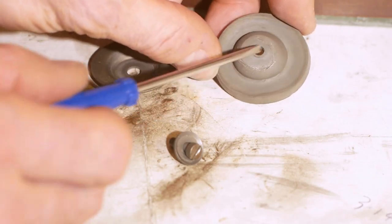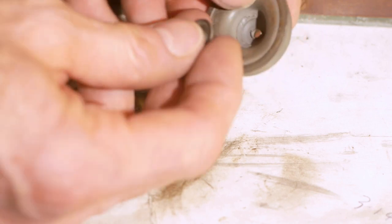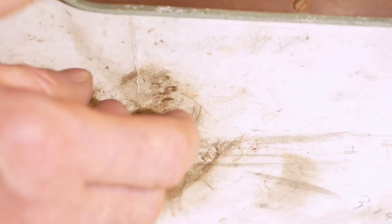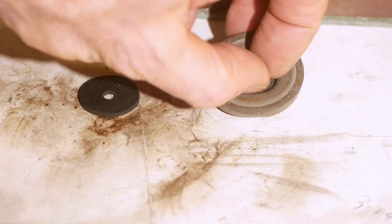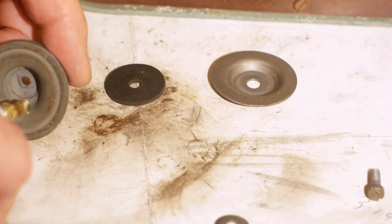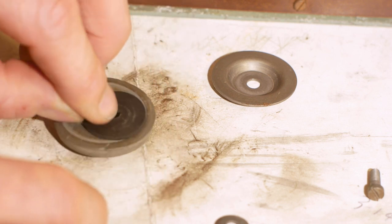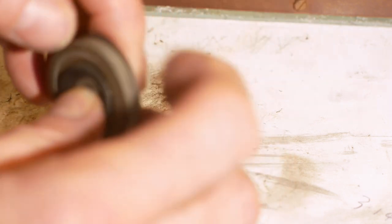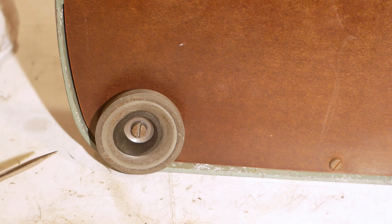For the torn foot, I've glued the tear together, but that won't be very strong. The normal method of assembly for these, there's a screw and a washer that passes through the rubber foot, and then it goes through another big washer that gives it the shape, and then it screws onto the machine. So I've cut myself a disc of rubber which I'm going to insert underneath the first washer and glue it to the foot to give it some extra strength. And here's the completed foot. The glue's still setting at the moment, but with a bit of luck, that'll do the job.